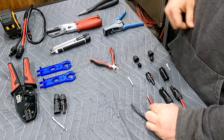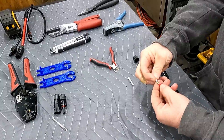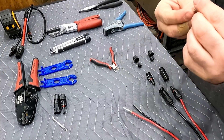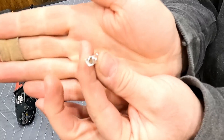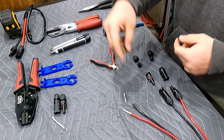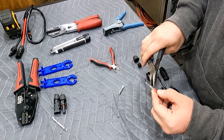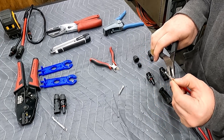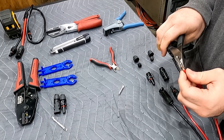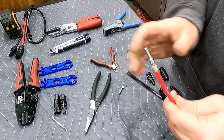The first part you've got to do is strip about a half inch to three quarters of an inch off the end of the wire — that's the 10-gauge wire. I'll go ahead and twist it like that. Now I know these are going to be the red wire setup, so this is going to be the connector that I need. I do have crimpers but unfortunately these aren't the proper type — you can see those little winglets that are supposed to curve in and clamp down, but mine don't work like that, so I kind of have to do it manually using some flat pliers to crimp it down and work around to make sure it's nice and tight.